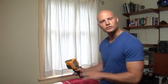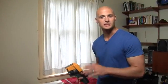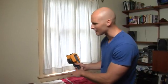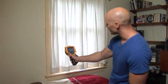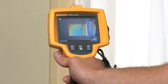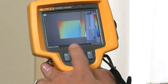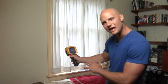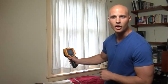Let's head inside and see what else we can find. I'm going to start out here in the bedroom by just scanning the walls. What I'm looking for is insulation that's possibly missing, deteriorated, or possibly just pushed down in the stud cavity. By pointing the imager up and down the wall, I notice a cool patch on the edge of the window which validates our findings from outside. What this is, is energy leaving the house, and that's money coming out of your homeowner's pockets.